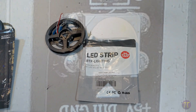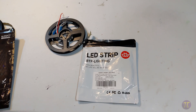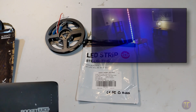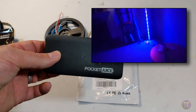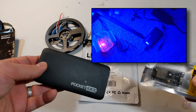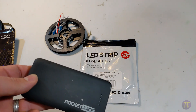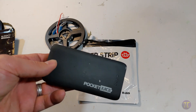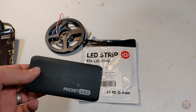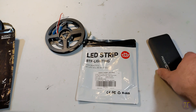Another useful feature is that instead of 12 volts, these are 5-volt lights. That 5 volts comes in handy — a couple days ago we had a power outage and because I chose 5 volts, I could power the entire lamp with a phone charger: a USB charger that gives 5 volts, 2.4 amps, powering the lights plus the controller. So keep that in mind — 12 volts is nice but you can't power your entire lamp off a phone charger.